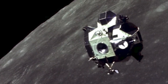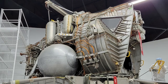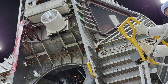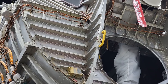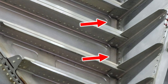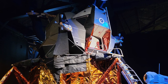Let's dive a bit deeper into some interesting details about the construction and engineering. The pressure vessel structure is almost entirely aluminum, with the exception of titanium fittings and fasteners. The construction method is actually fairly similar to how planes are designed and built. A very thin skin forms the airtight volume, and the structure is given stiffness with ribs and stringers — basically all of these grids and protrusions that you see around the pressure vessel. The skin is chemically milled away in some areas to reduce thickness even further, which can get down to a thickness of less than 12 thousandths of an inch, or 0.3 millimeters. You can see why they needed a micrometeoroid shield on the outside of the structure.